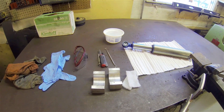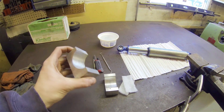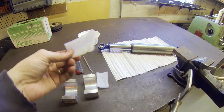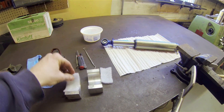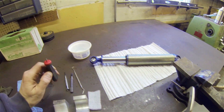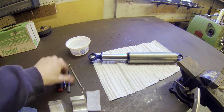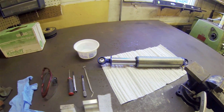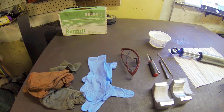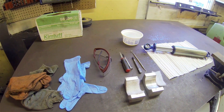So these are the tools I'm going to be using. I have these vise clamps that I built — I'm just going to be putting some plastic in there to protect the shock body, and then we'll clamp that in. I also have an assortment of little tools to release the pressure and pull some snap rings out. Make sure you're wearing your eye protection because these things are under very high pressure — you don't want to get this stuff in your eye. Let's start taking this apart.